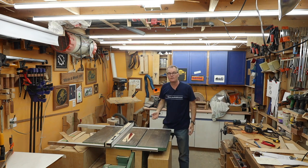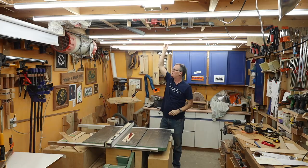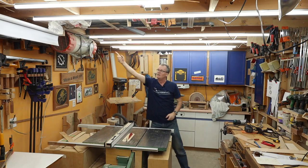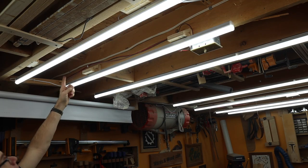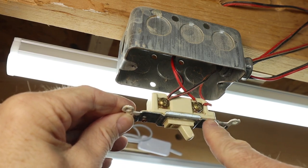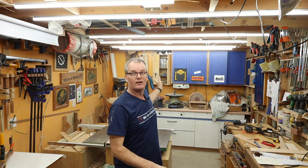And again because of the design it was a very simple matter. I put a simple light switch here, I've got the low voltage wiring from this switch running along the joist there along the side of the room, and then it comes up to this switch where it just bridges the terminal so the two switches are running in parallel. So I could turn it off and on here or turn it off and on there. Great design — I'm really looking forward to this just making my time in the shop that much more enjoyable.